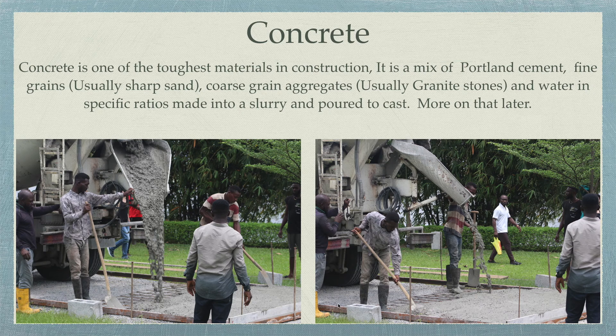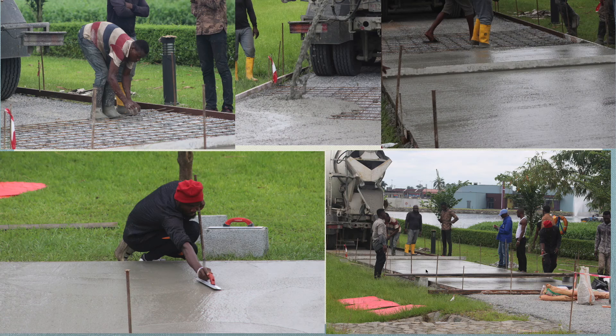After pouring the concrete you have to spread it into the entire form, as shown here. One important mistake many inexperienced people make is placing the reinforcement directly on the floor and just pouring the concrete on top — that is a very serious mistake. Doing that defeats the entire purpose of reinforcement. Reinforcement is supposed to be like a sandwich: you have bread, butter in the middle, then another slice of bread. The reinforcement is supposed to be the butter in the middle of the concrete.